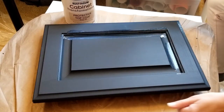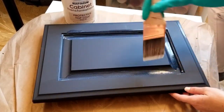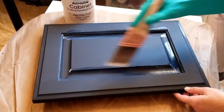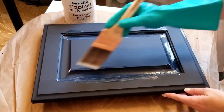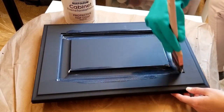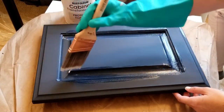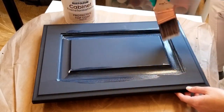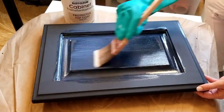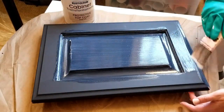When adding the top coat to the door fronts, I recommend using a one-inch paint brush instead of the two-inch I used here. The two-inch brush held on to too much of the top coat when working around the raised panel, so all the brushing and rebrushing to get rid of drips actually made more drips and incorporated a lot of air bubbles. A smaller brush would give much better results in those spaces.